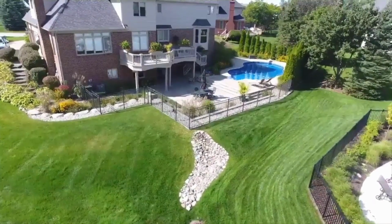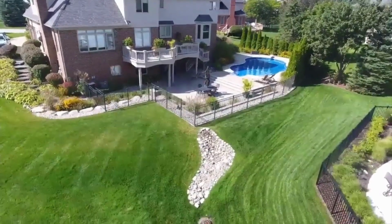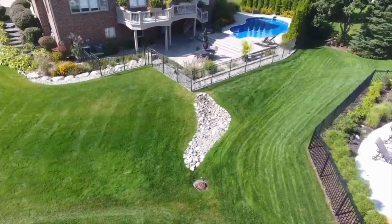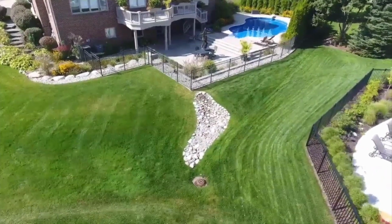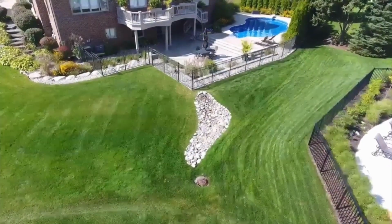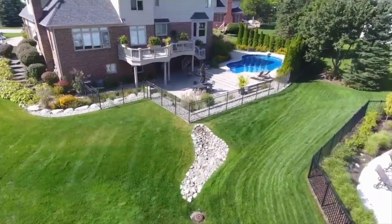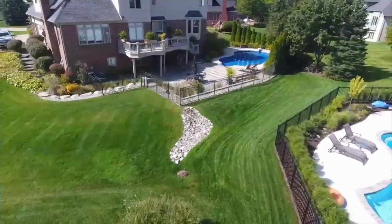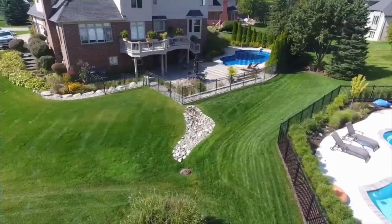Well, what happened was there's a pool to your right. You can see a little bit of the deck and the fence around it. Not the homeowner I worked for, but behind them. They used to displace a fair amount of that water along with my client. Once they put that in-ground swimming pool in, they had to elevate the whole yard in order to do that. They no longer displaced any of that water, and it all ended up on the homeowner that I was working for. So there are so many things that change drainage, change standing water, the amount of water in a yard.